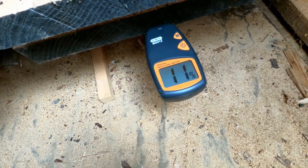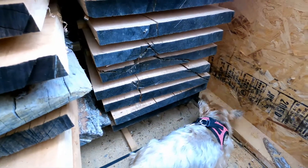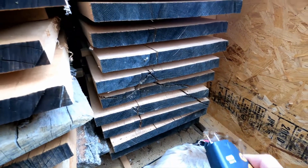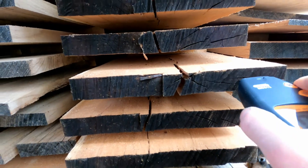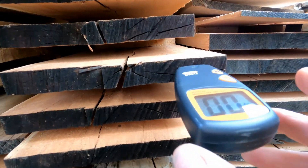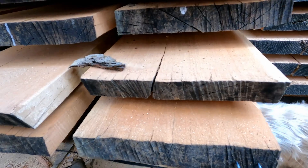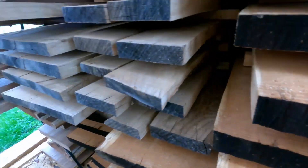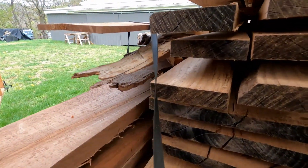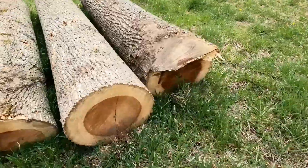Going in deeper and lower, the wood that's coolest down there is jumping between 9 and 11 percent. These boards have been in here maybe a month already, and we're in early spring here in Pennsylvania so it hasn't been getting terribly hot. When they went in they were probably around 40 percent. The pin oak is basically dry — I'll give it another week or so.